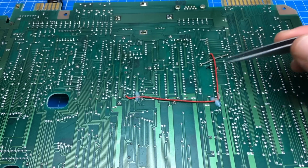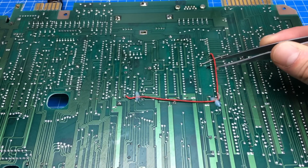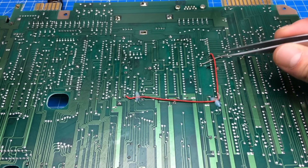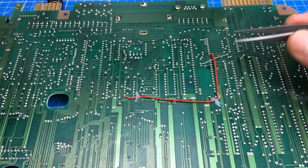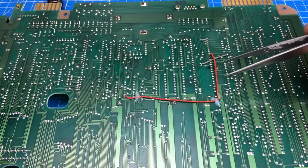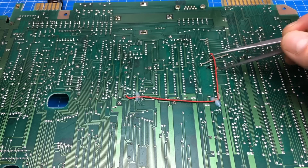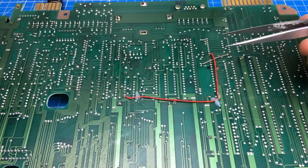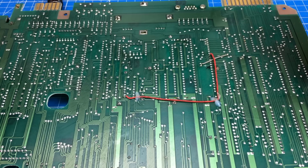You engineers out there, don't put your botch wires anywhere near through-hole pins. And to every other person troubleshooting these things, it often is the very, very simple stuff. I could have seen this by just visually inspecting the board a bit more thoroughly from the start. I didn't believe this would happen, but it's always the simple stuff that just happens. So I'm going to put some insulation there, and that's going to be fine.